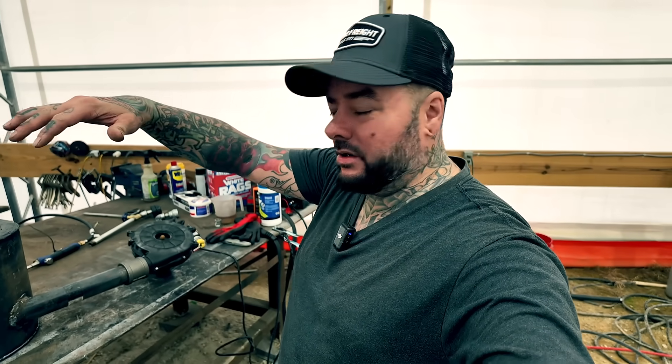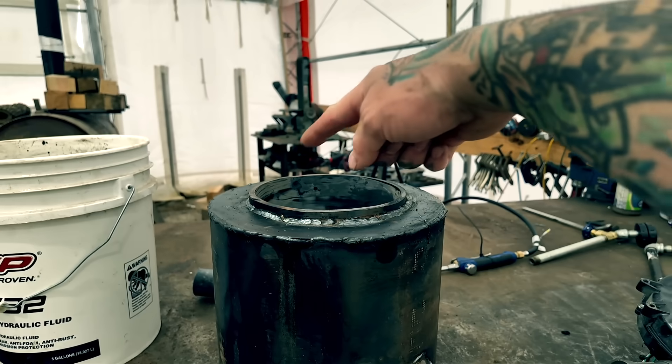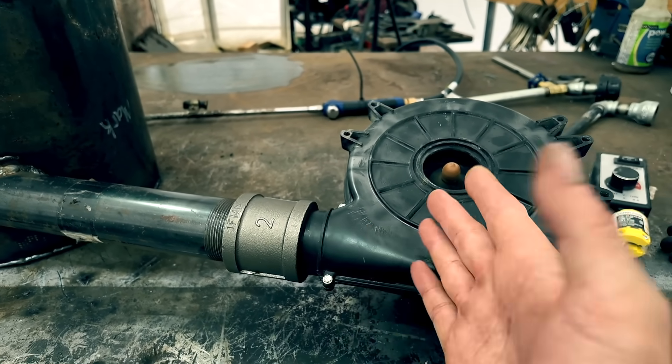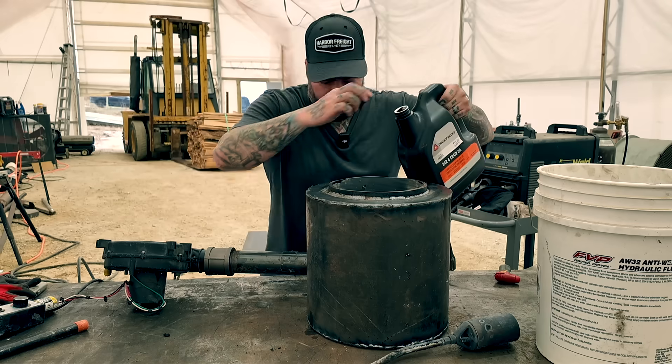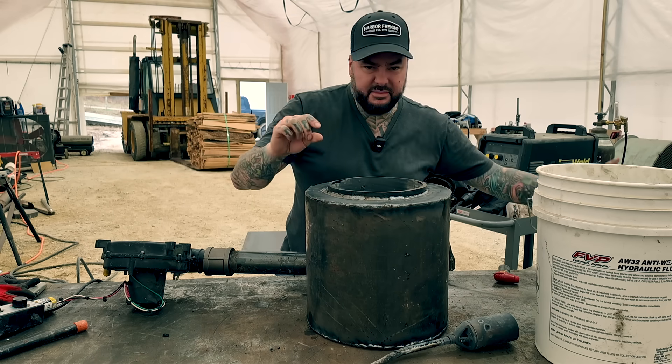All the welding is done — I did have to weld all the way around solid, so if I need to enlarge holes I'll have to use an angle drill. The air tube is welded in, top and bottom are welded in, and that's where the oil goes. I coupled the fan on — it kind of made a little thread so hopefully it holds. Before setting up the drip, I want to pour a little oil in there, light it with my weed burner, and see if it actually works. I have some bar and chain oil — I'll put a small amount in, maybe a sixteenth of an inch.